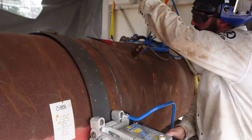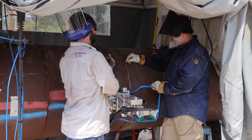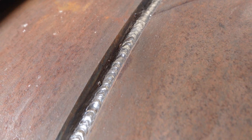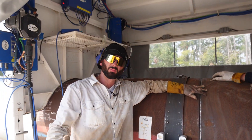Just a single head. Instead of going from top to bottom, we're going bottom to top when it comes to tie-ins. You still need the rig welder out there. They come in and put the bead in — a cellulose bead, cellulose hot pass — and depending on the procedure they might do a hot fill on top of that. Then we're going to put a fill in here and maybe cap it.